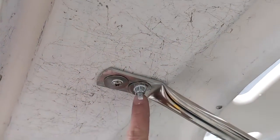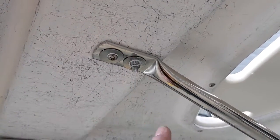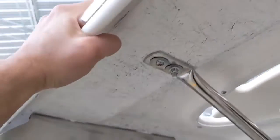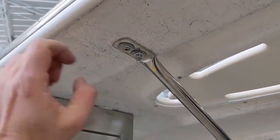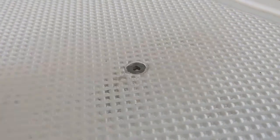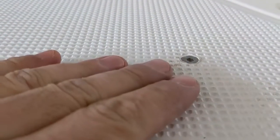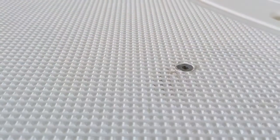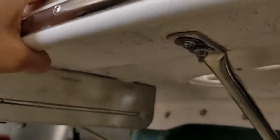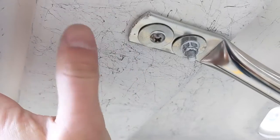And then at the top end, underneath the swim platform, the forwardmost bolt, you use a 1/4 inch drill bit, drill all the way through, and you wanna use a drill from the bottom upward, very gently, so you don't split any fiberglass. And then you wanna countersink the top side. You countersink it so that the angled head Allen bolt fits flush with the surface of the swim platform. Countersink it, and then the rearward one is where the wood screw goes, the stainless steel wood screw.